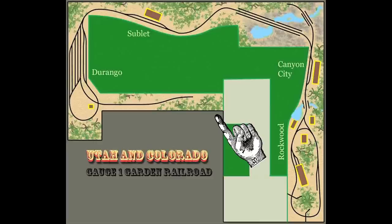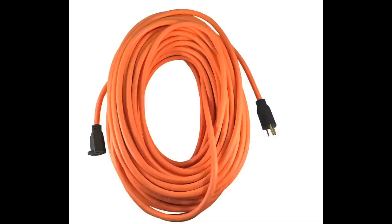That kept the voltage from dropping because the bus was fed from two different ends of the railroad — all from the same location — so it was a giant loop rather than a dead end. The most distant point was straight across the yard from the shop, so I had almost 400 feet of outdoor-rated wire buried under the track. On a budget, I used orange extension cords — just as handy as duct tape. Being a grounded cable it had a black wire, white wire, and green wire: green for the common rail, white for bus A, and black for bus B.